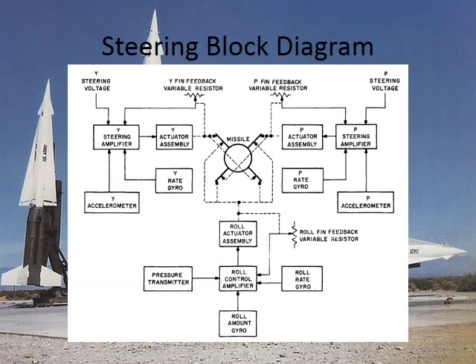This is just a picture of the ailerons in the back and how the thing was steered or controlled with X and Y pitch and roll commands. When we assembled it, we had to also assemble and prime the hydraulic system that would power these. We had a hydraulic test set — the acronym was Pumping and Filtering Units, so we always called it a PUFU. To hook that thing up, you'd just get nasty — there was no way to hook it up without getting hydraulic fluid all over you. We would have to run it and filter the hydraulic fluid for four hours before we could certify the guidance control system to work. During the end of that four hours, we would hook up a radio frequency test set to feed the antennas and the guidance control system the commands to do rolls, pitch, climb, dive, and various commands — ensure the right elevons moved in the right position when the correct commands were given. Otherwise, we had to disassemble it and do it over.